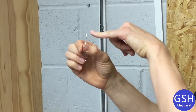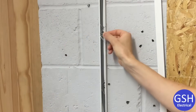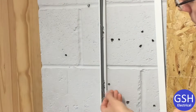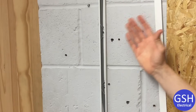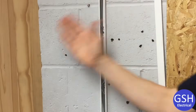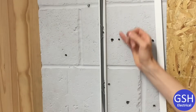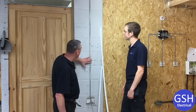We've spaced these quite close together just to illustrate a point. If we were installing these on site, we've taken the decision to rotate the orientation of the clip. You can see the clip has a little return leg to hold the cable in the horizontal position as well, stopping it from falling left or right. By rotating the clip orientation, we're maximizing its potential — making sure it won't fall out to either side and then fall forward. We think that's quite a good approach.